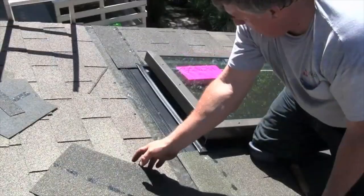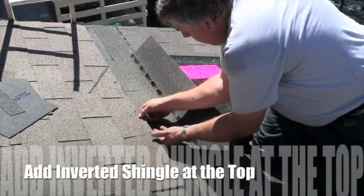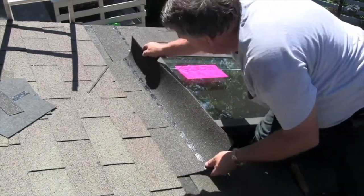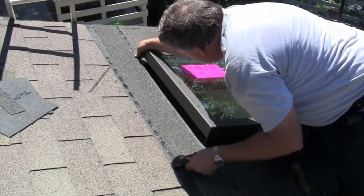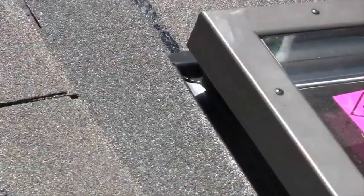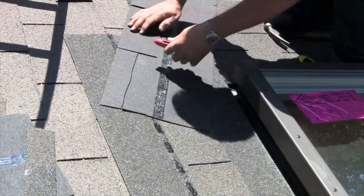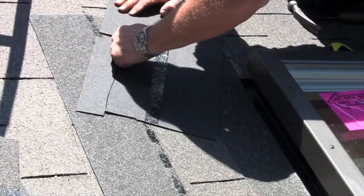At the top side of the unit, place one shingle inverted across the entire width of the skylight before proceeding with your shingles. It must be placed on top of the L-shaped primary diverter to cover any seams, tap slots, or edges that may allow water to get onto the roof deck surface. This inverted shingle step is very important. The top shingle also gets a special trim slot detail, where the shingle wraps around and down the side to transition water flow from the top to the sides of the skylight.